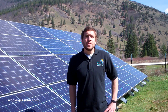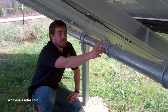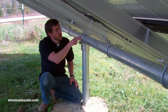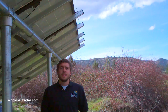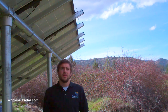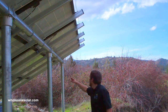Now that we've taken a look at the various components of the ground mount system, let's get up close and see exactly where they're located on the ground mount. We've got the XR1000 rail right here, rail connector bracket, 3-inch U-bolt, horizontal 3-inch pipe, vertical 3-inch pipe, Iron Ridge top cap right here, two set screws in the back, two U-bolts securing the horizontal pipe. You're going to replicate this same thing on your northern piers in the back. As you can see, the piers in the back are going to be much taller — this is what sets your tilt angle. Your technician at Wholesale Solar will design the system based on your location and your power requirements. We can adjust the tilt angle from a flush mount all the way up to 45 degrees. You'll see we've just replicated the same thing we did in the front — top caps, rail connector brackets, same thing on every pier going down.